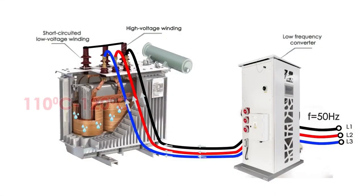As a result, the high and low voltage windings are heated from the inside to a typical drying temperature of 110 to 120 degrees Celsius. To prevent overheating, the temperature of the windings is constantly monitored during the drying process. Because the heat source is the winding itself and heating comes from the inside, removal of water proceeds faster and more completely.